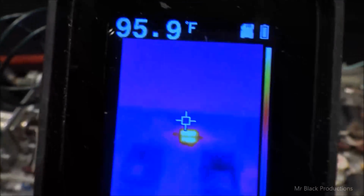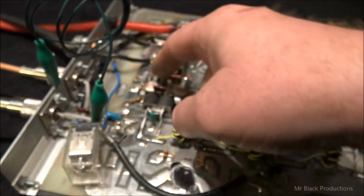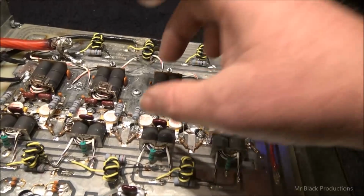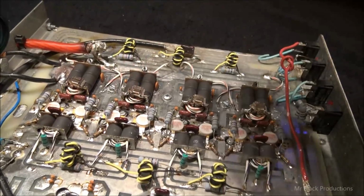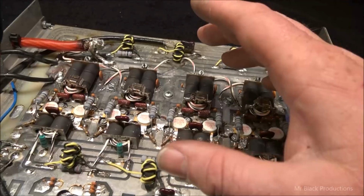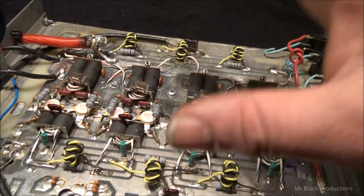we've got a real hot spot over here. And we're seeing our output resistors getting real hot. And if we go and look at each one of the two transistor units, because this is an amp, this is an amp, this is an amp, this is an amp, this one's dead. So something in this circuit has gone toast. So we don't have any burnt 10 ohmers, but that's not always an indicator that one of the pills has not gone down.